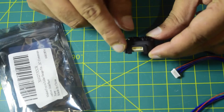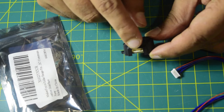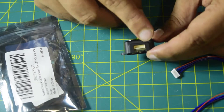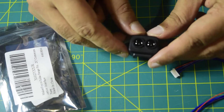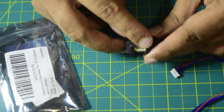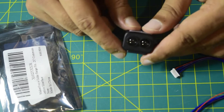As per the wiring diagram, when you orient the sensor in this direction, pin number one is on this side going all the way to pin number six. Pin 1 is VCC, pin 2 is RX, pin 3 is TX, and pin 4 is ground — that is how you connect it for UART. This sensor supports dual-mode connection: if you ground pin 5 you can use pins 2 and 3 as SDA and SCL for I2C. I am going to connect it to the UART port, so pin 5 is left with no connection.